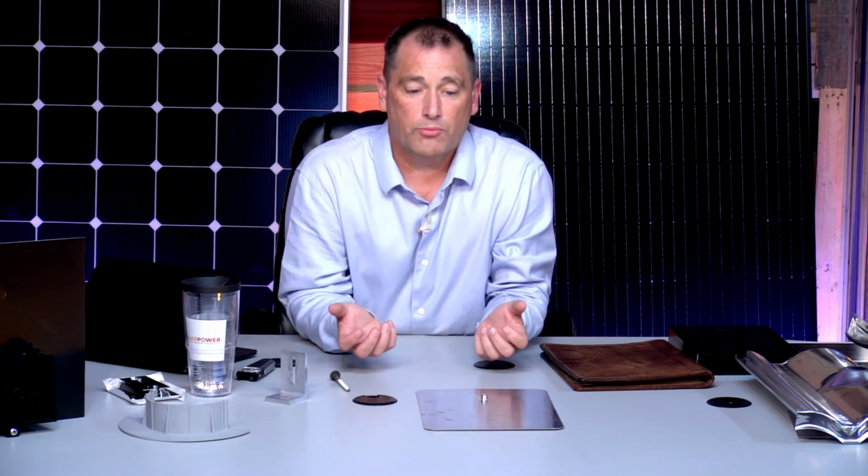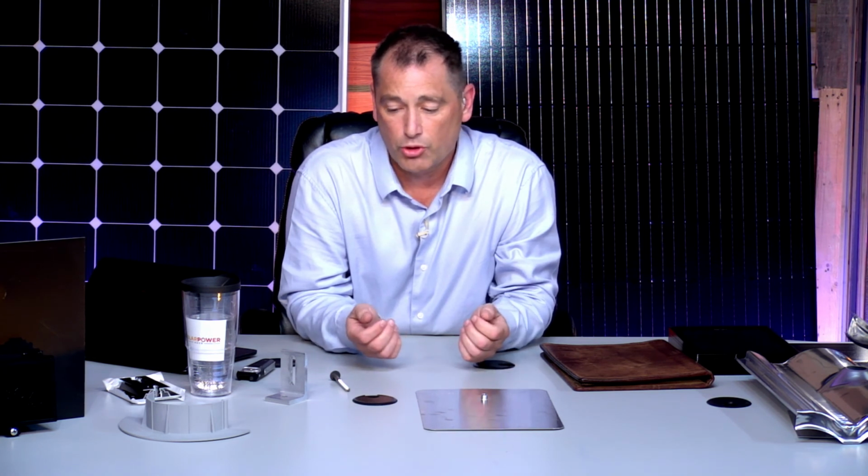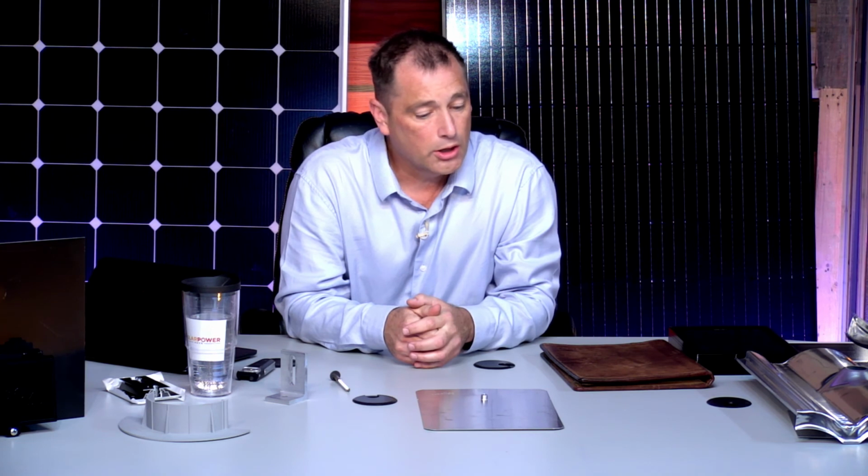You only have so many rafters that are either 18 or 24 inches apart. Sometimes they span them 6 feet apart and you're okay. Like in the middle of the array, you might be 6, 8, 10 feet apart before you have to put more in. But down towards the lower levels and the corners, you're putting more because those are the parts where the wind is more susceptible to grab those modules and rip them up. So the bottom row is usually about 2 feet, sometimes they're 4 feet apart. You'll have those L feet with a 4-inch lag every 2 to 4 feet.